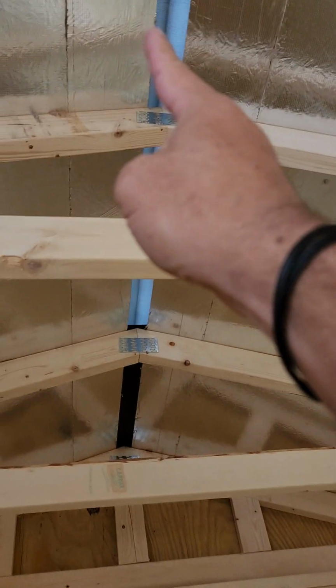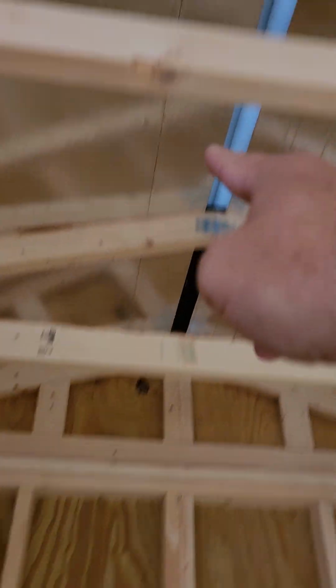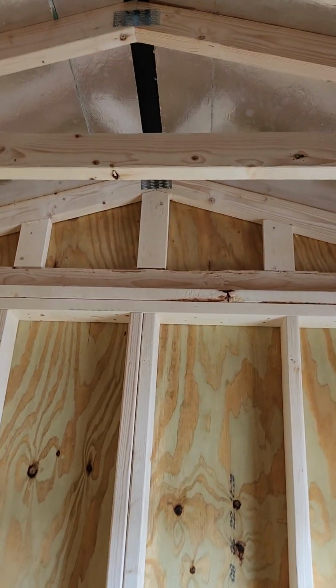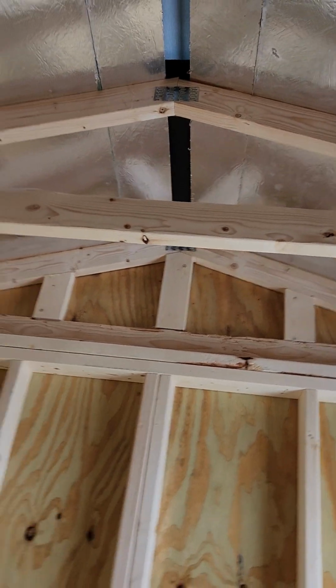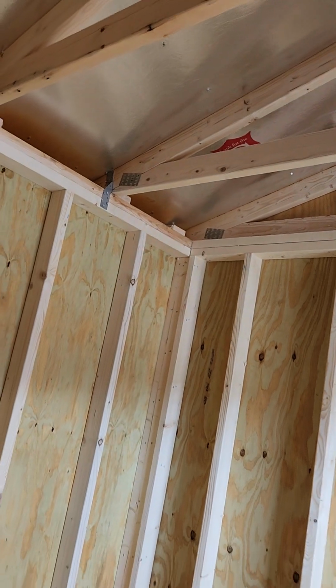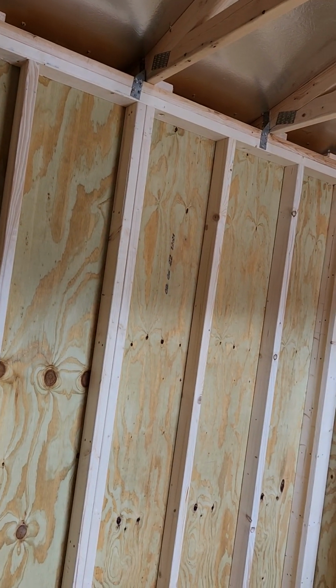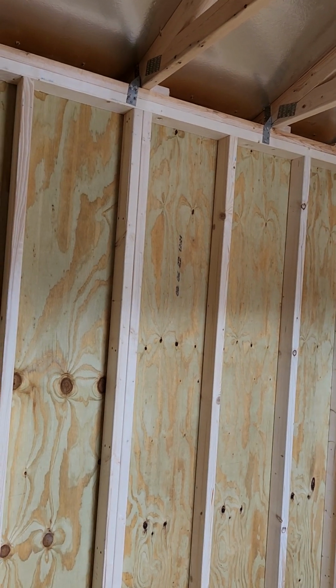Now, also standard, at the top of our walls, I'm going to reach the camera up here and show you, we put this soffit ventilation system on the left and right sides of the building. It goes all the way across, and it's for an improved airflow. Airflow comes in and goes up, it goes out those roof ridge vents. That's a screened-in roof ridge vent that runs all the way across there. All right, screened in to keep out bugs and debris, but it improves your airflow. It makes a difference in the hot, humid, crazy summertime extreme temperatures. This building will stay 10 to 15 degrees cooler on average.